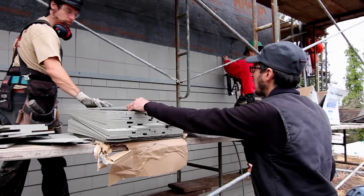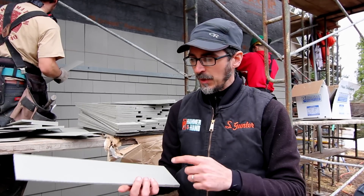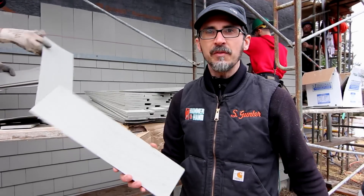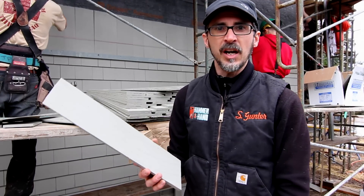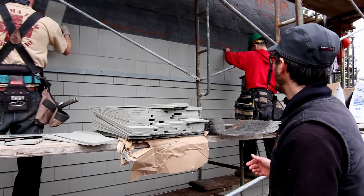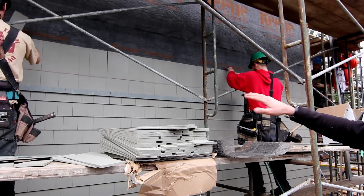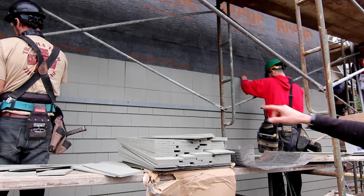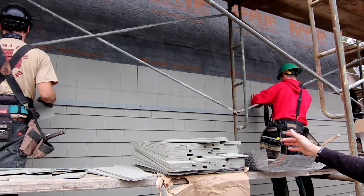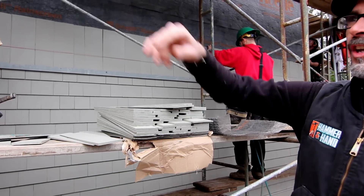You can see the crew back here starting to install. What we're using is a pre-painted cedar shingle — totally clear vertical grain, painted on five sides. It's a lifetime product. You can't really build a cedar rain screen any better than this. The crew is setting it up in an old-school way — one guy loading shingles all the way across, another guy coming through and stapling. We're using a stainless steel staple so it doesn't stain, and we just run the whole way across and set these courses up.